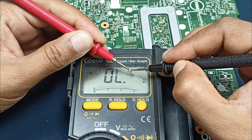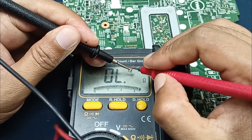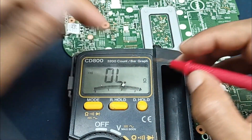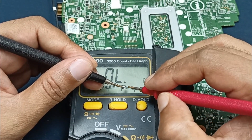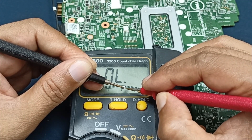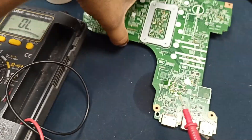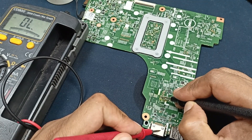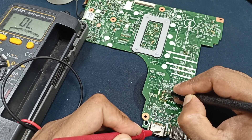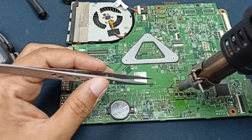This must be the short — okay, let's change the polarization. This one is showing short. Let's check another one — what happened with this one. This one is okay, no short circuit. We found the problem. This MOSFET is okay, no short circuit. And checking this one also — no short circuit showing. This is the ground pin, no short circuit. But this MOSFET from positive to ground is short, and that's the 3.3V rail. This is another motherboard from Dell.